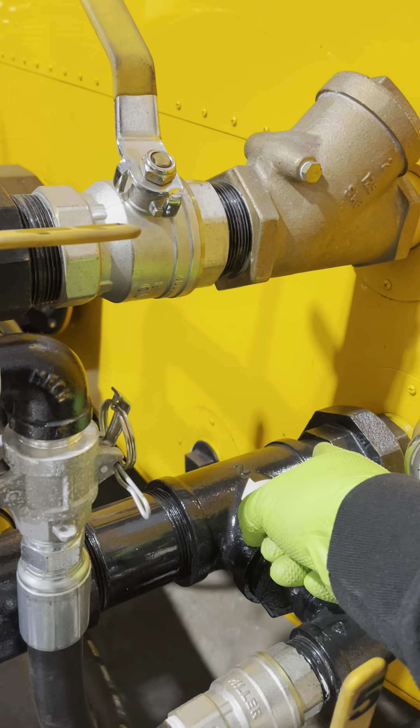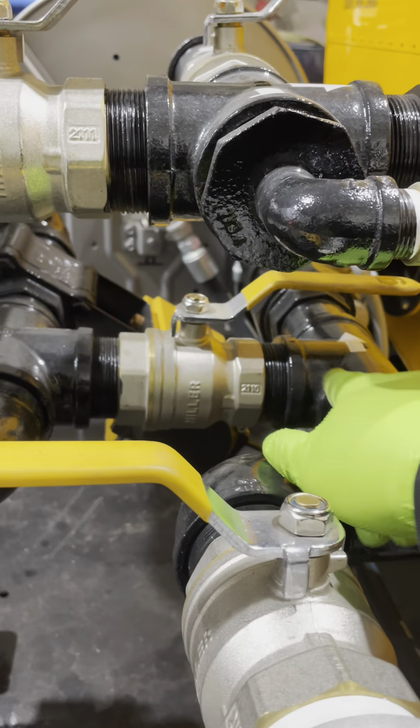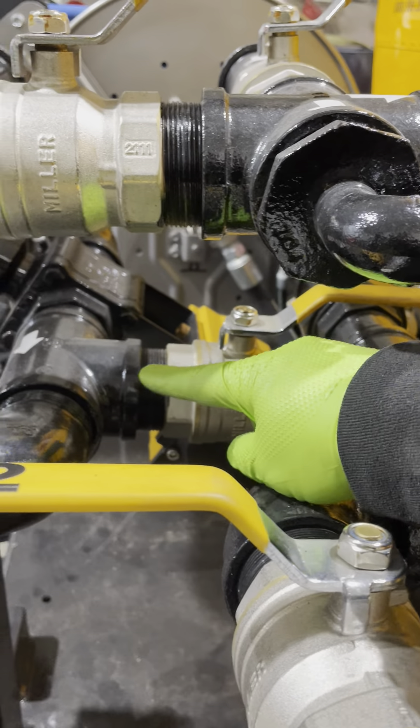All the clean air is going to route from this point where it enters the rear manifold, go down through the plumbing, hang another left, go down and around all through the spray bar, and back up to number eight. It's going to follow eight right back up to here. Then it's got nowhere to go because ten is closed — return to tank — but eleven is open, which is the return to solvent tank. Everything will be pumped back to the solvent tank. That's our air clean-out procedure and solvent recovery.